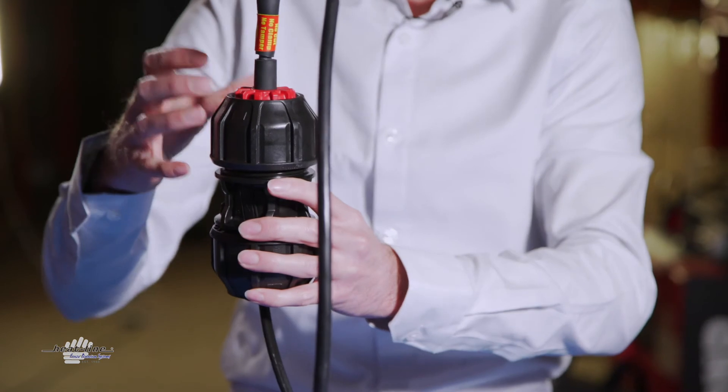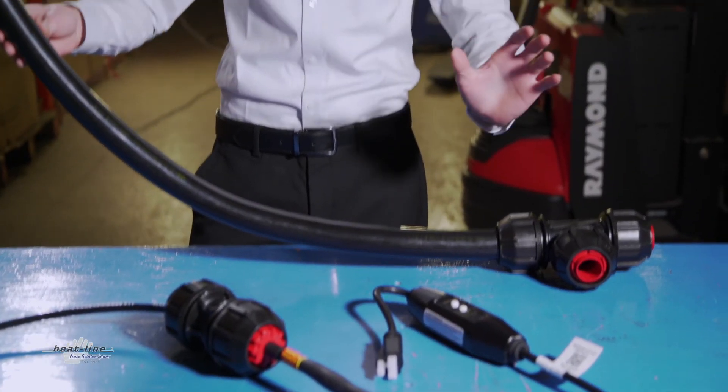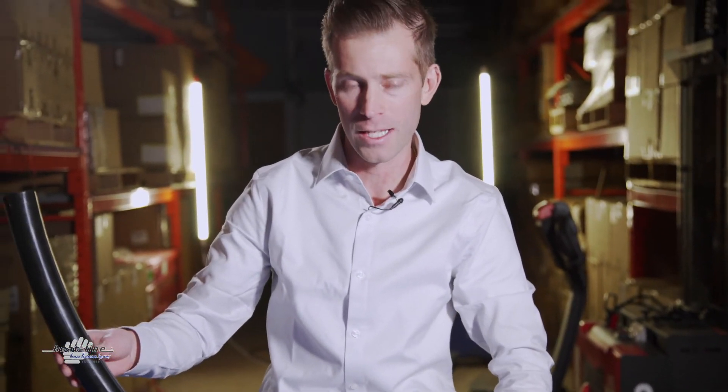By creating this sweeping 90-degree bend and using the stub pipe to come up to the surface, this will allow us to actually interface the RetroLine above ground, energize the system, but yet maintain constant serviceability of the product through its years of service.